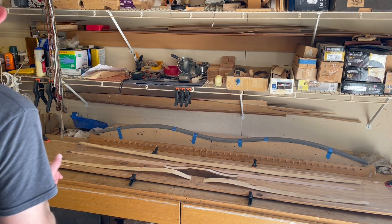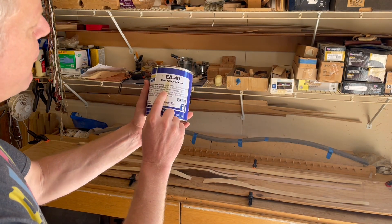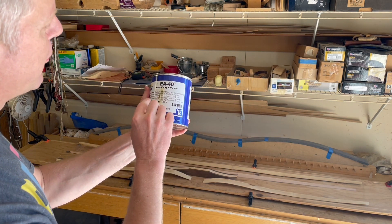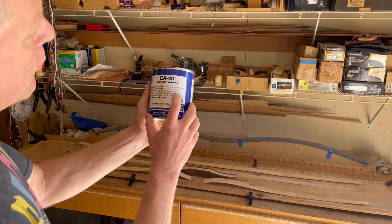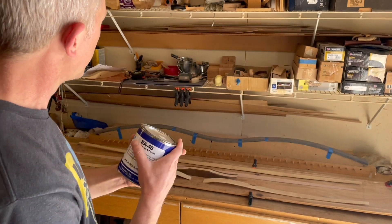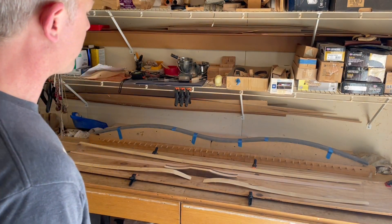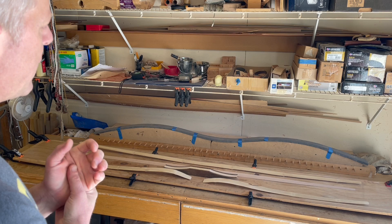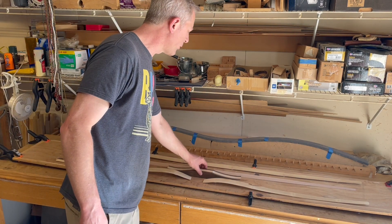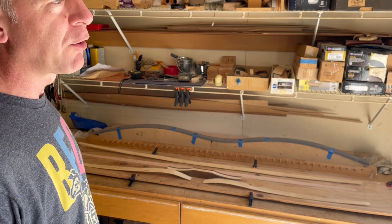For glue, we're going to use EA-40 epoxy. The instructions talk about doing one-to-one ratios, but there's a part that says when mixed two-to-one by volume, it will achieve greater heat resistance and improved physical properties. The technical sheet talks about a heat distortion value of 217 degrees, and also mentions curing any project at 250 degrees for two hours to improve the heat distortion qualities of this glue.